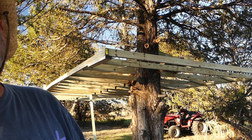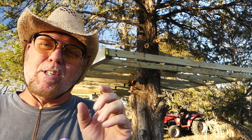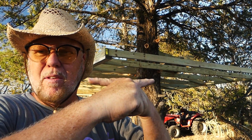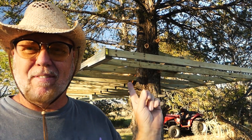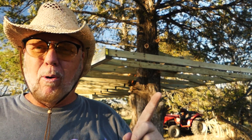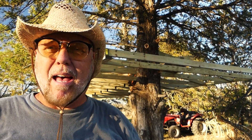I'm pretty happy with my evening's work. I've got about 45 minutes of sun left. Let's talk — you saw how I boxed that in, normally in 8-foot sections. I wish I would have staggered them — bought 8-foot and 10-footers and staggered so I wouldn't have two joints halfway through one joist. It would have overlapped. I might pry up some of the middle ones and put in a 20-footer. I can see a little wave going down that I want to take out. It's suspended over that pole and I know that pole deflects 4 inches, so if I don't put anything in the middle I'll have a 4-inch swayback roof.